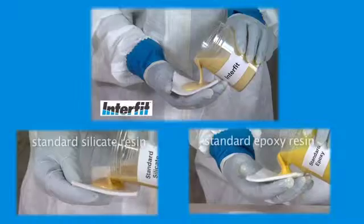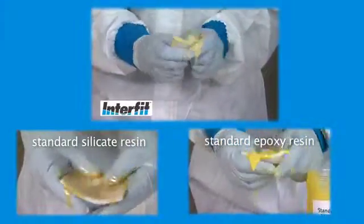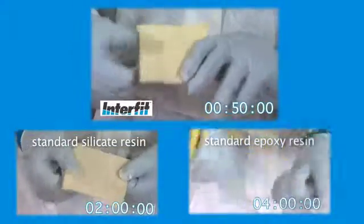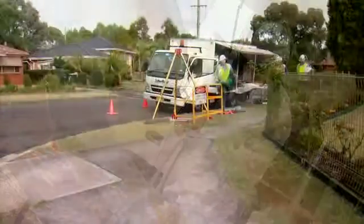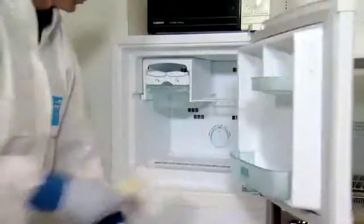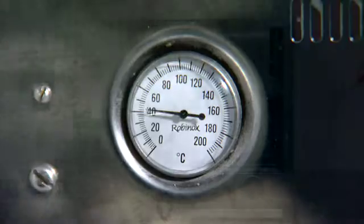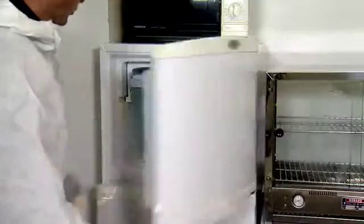Comparing this to other silicate resins and epoxy resins, we would typically find that with working times of around 20 minutes, the cure times would be several hours, or would need to be heated in order to accelerate the cure times to under 30 minutes. The Interfit resin system is also largely unaffected by ambient temperatures. The pot life does not change significantly whether it's being used at temperatures of 0 degrees or 40 degrees. Similarly, the cure time is also largely independent of the ambient temperature. This means that one resin can be used all year round and in a wide range of geographical conditions.